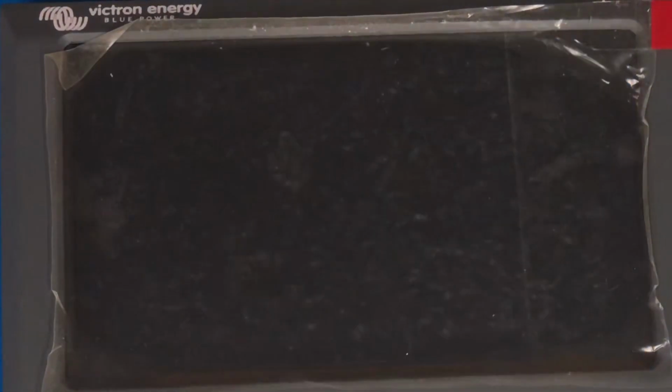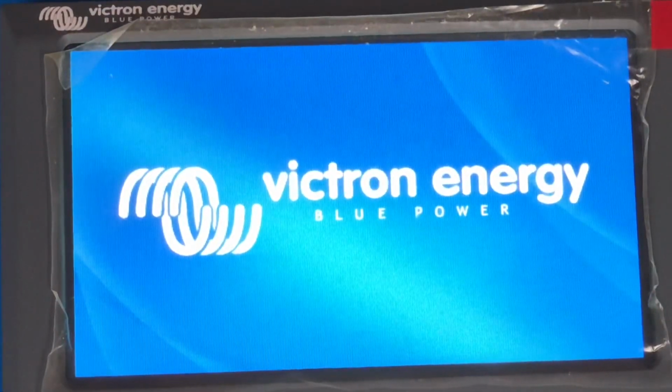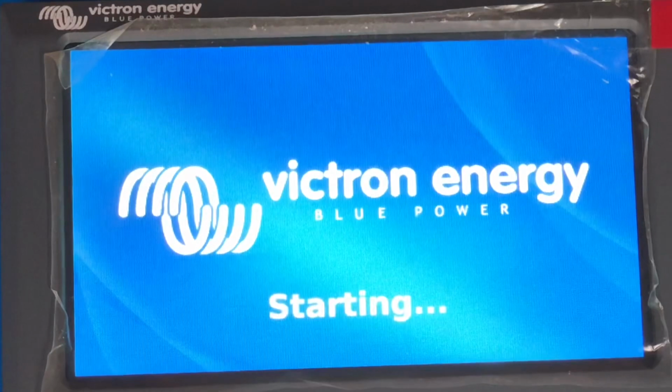A point of note here with the Freedom 1, even though we've got no communication with it at all, we are connected obviously with the power. The Freedom 1 will retain the power to allow us to go through the process. Other lithiums that we've come across, if there's no connection, they turn off, which is a bit painful because you've still got a pile of settings to do. So as soon as this restarts, I'll go through the other set points. The inverter itself, we have to flash the latest firmware in that, and we'll go through that next once we set up the basics in the CCGX overview here for you. And then we'll get into the back end of the inverter itself and the charge controller so it works properly.